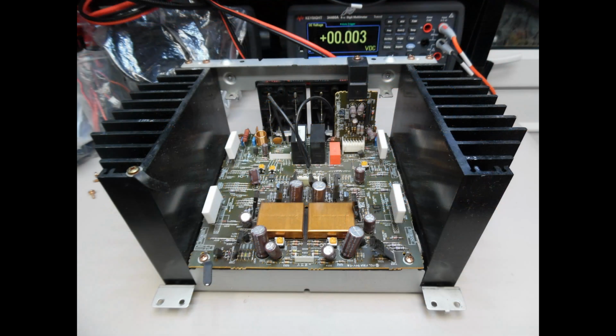Now in this photograph what I've done is I've put the rest of the amplifier to one side, and this is the amplifier. And what you can see are the large heat sinks left and right, and then towards the rear of the amplifier, and I'll show you another photograph a little later, are the speaker protection relays. And because you can have two sets, then there's a relay for system 1 and then system 2, and these are double pole 24 volt changeover relays.